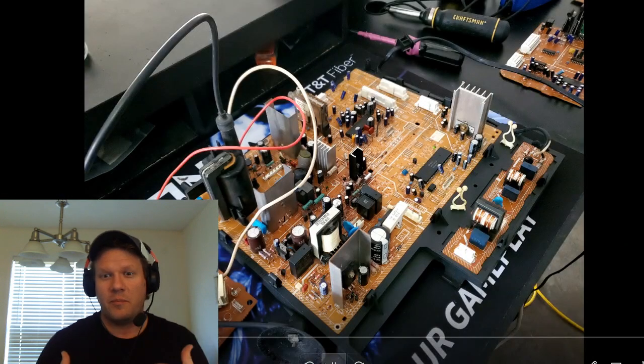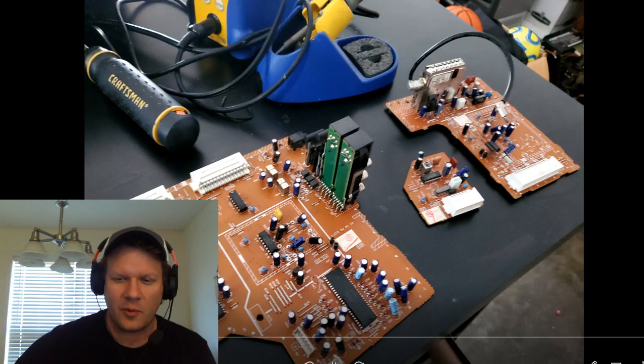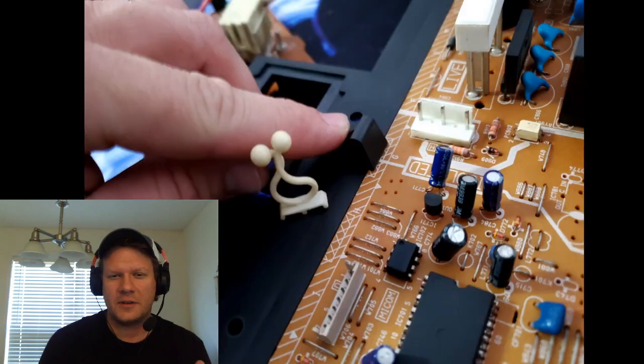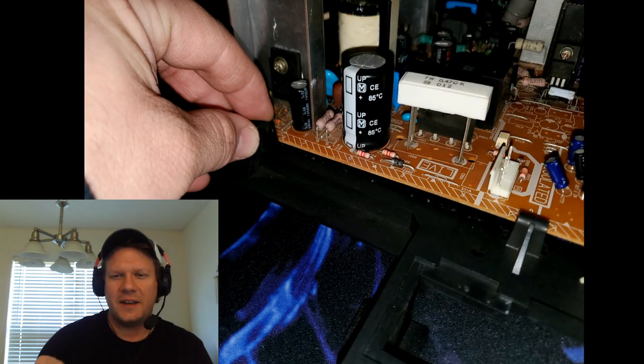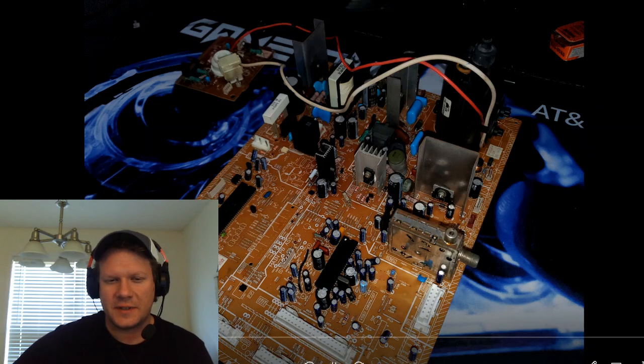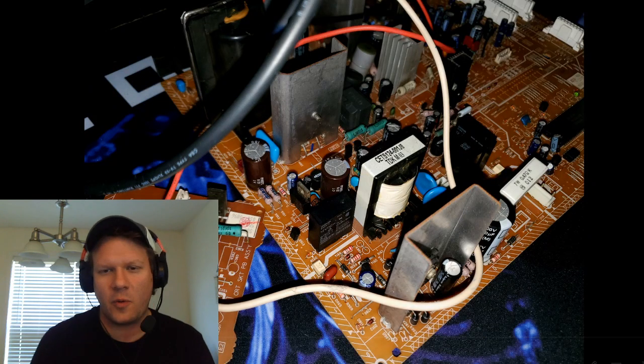and basically the whole board work, or what we'd like to call circuit board work here. We've got the chassis pulled, and I've got all the cards pulled out of the monitor. We've already gone ahead and taken the television apart. First thing I need to do is get the main chassis out of the black plastic frame. There were a couple of clips that I showed just a second ago. If you pinch those clips, you can pull this board out quite easily.